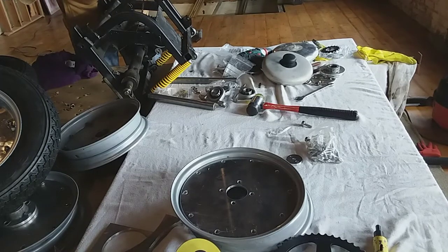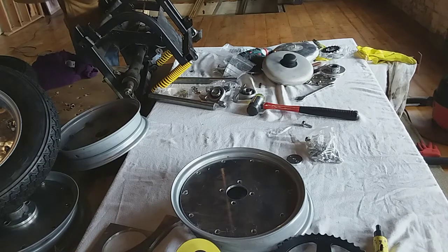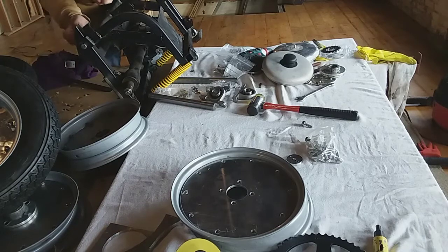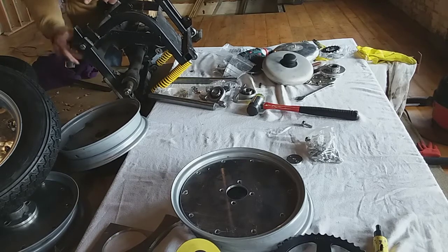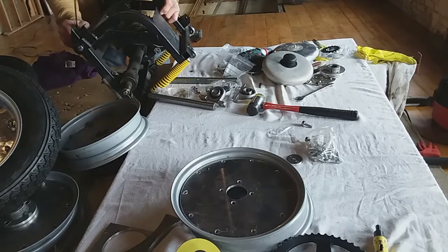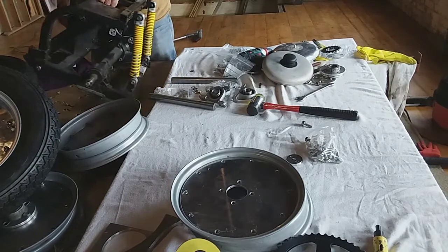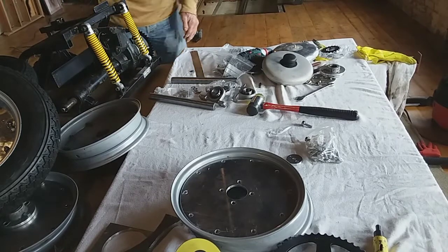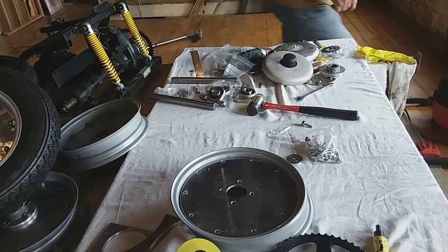These are stainless steel bolts and you measure it from there to the end - not the whole lot. So what these are: these are 65mm M10s, which are going in there. Obviously I'll put washers on there and that has made it much stronger, because I like to make things stronger than they should be. 35 stone going up and down on that - it's a bit feeble for an M8 really.